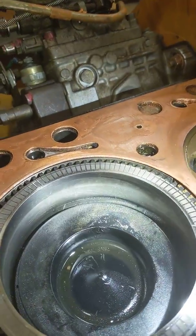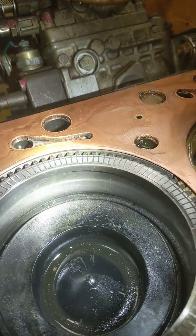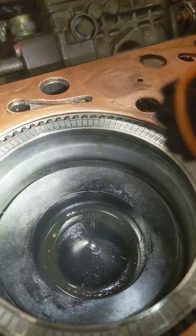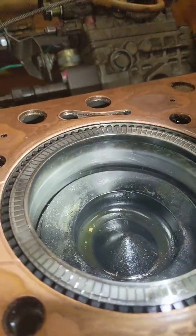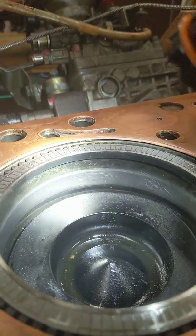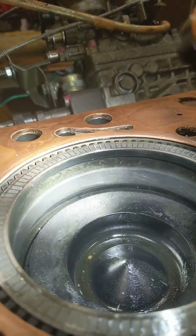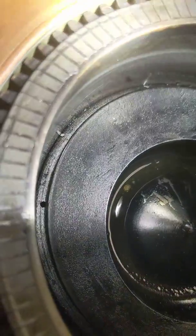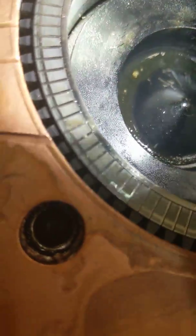You can see the top of the liner, and you can see the areas where the sealing zone and the load support zone is located. You can see some of the nine supply holes for the oil that's coming from under the rotating liner into the face seal.